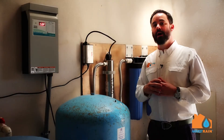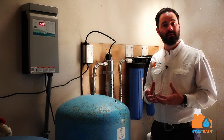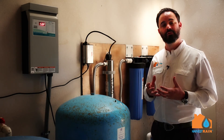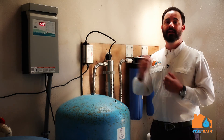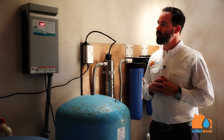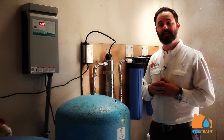This particular model is an Aquavar Solo 2, which is a submersible water pump that we use to give pressure to the entire system. The pump is sitting in the bottom of the water tank, providing a pressure source, and then comes through the filtration set, through the UV, and then into the home. We love this model because we've got a controller readout that allows us to know what's going on with the pump at all times.